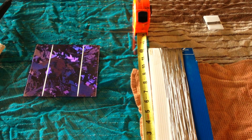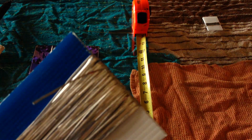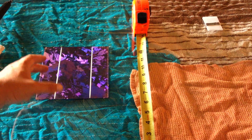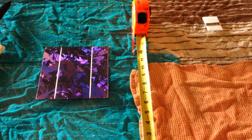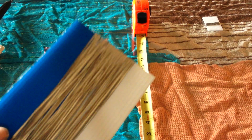We are now getting ready to start tabbing our solar cells. The first thing you're going to do is cut your tabbing wire to the right length. Some solar cells come pre-tabbed, where the solar cell already has its basic tab on it and leaves off just a tiny bit. I don't have those, so I'm not going to demonstrate those. What I am going to demonstrate is how to properly do untabbed cells.